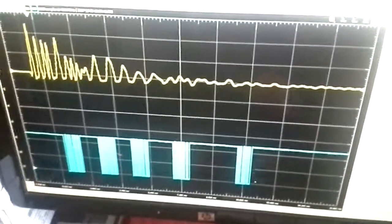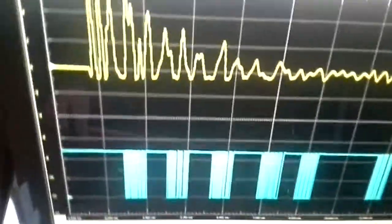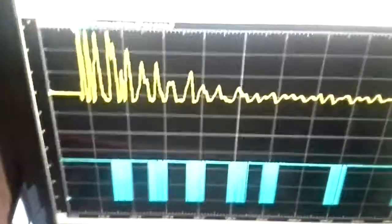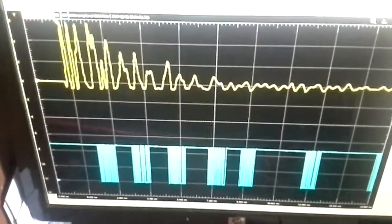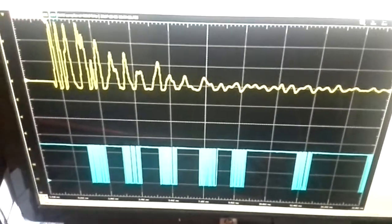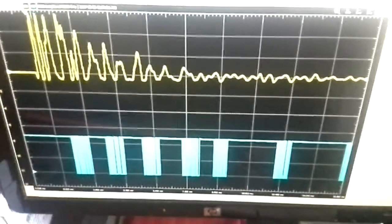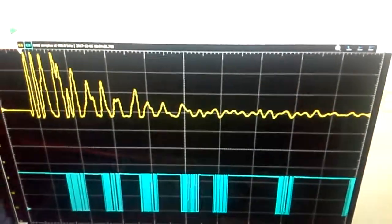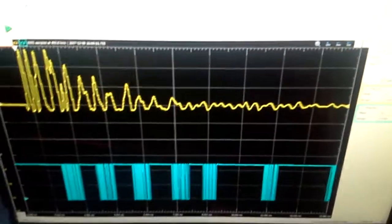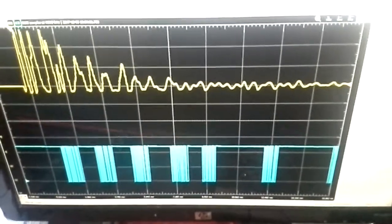And we see the yellow line, and so I can keep talking, I'm going to grab one single signal. We see that the yellow line is the analog signal. It produces up to 5 volts input into the Arduino microcontroller, and then we see that the blue line is a series of digital data sent over serial output from the microcontroller to the Bluetooth module, which then is received by the Android app, which will be shown in part 2 of this series.